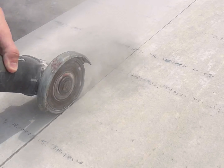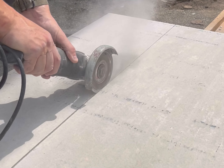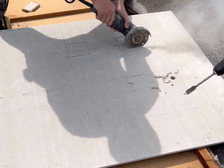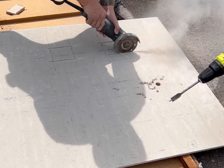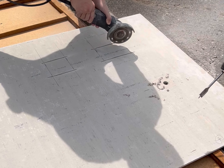We tried to install enough shelf brackets so that the weight was distributed evenly throughout the shelves. After all the shelf brackets were installed, we then began cutting our cement board. We used a grinder to cut the cement board to the correct size and also to cut out any of the spots for the outlets. We also had to cut out all of the holes for our floating shelves, and for that we used a paddle bit attached to a drill.